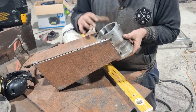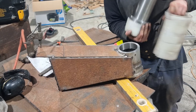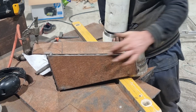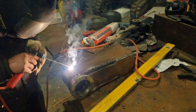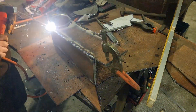The gear will slide up through and be held on, and then the motor will be mounted here. I'm going to weld all this out now. Again, the welding took some time because I jumped around the part and let it cool between passes to reduce warping.